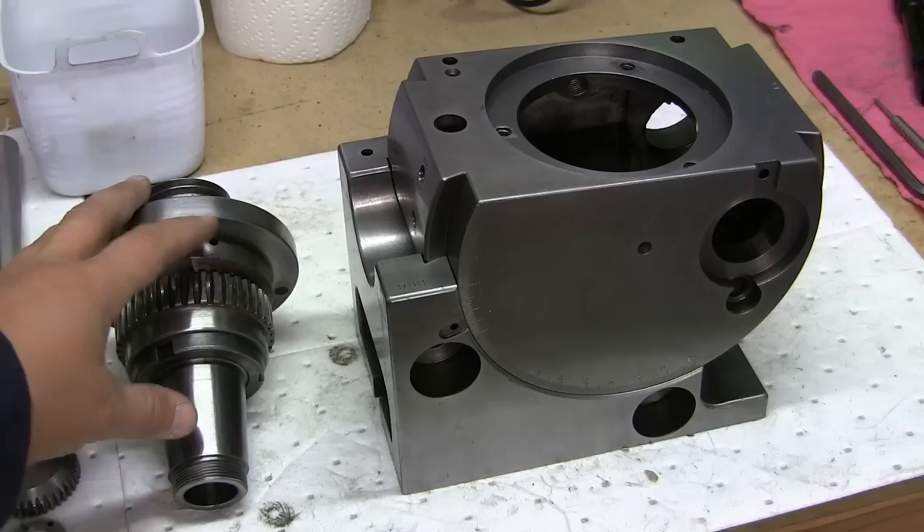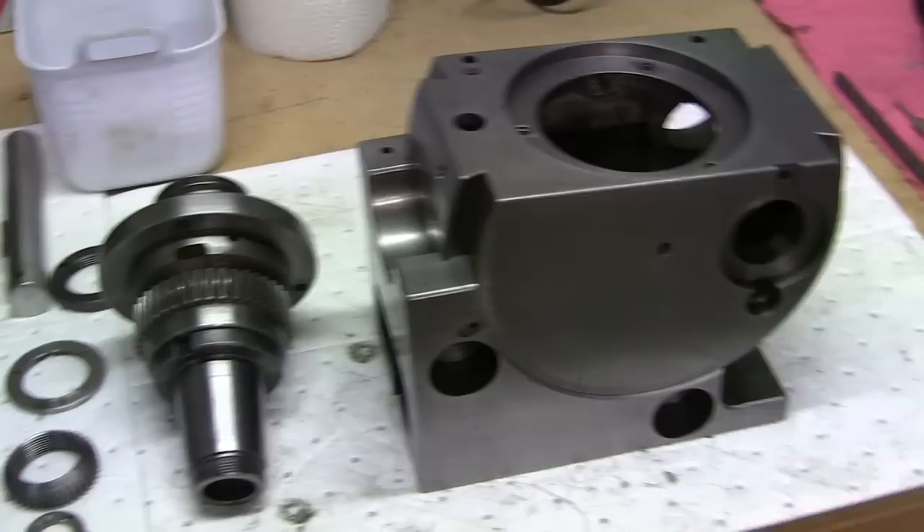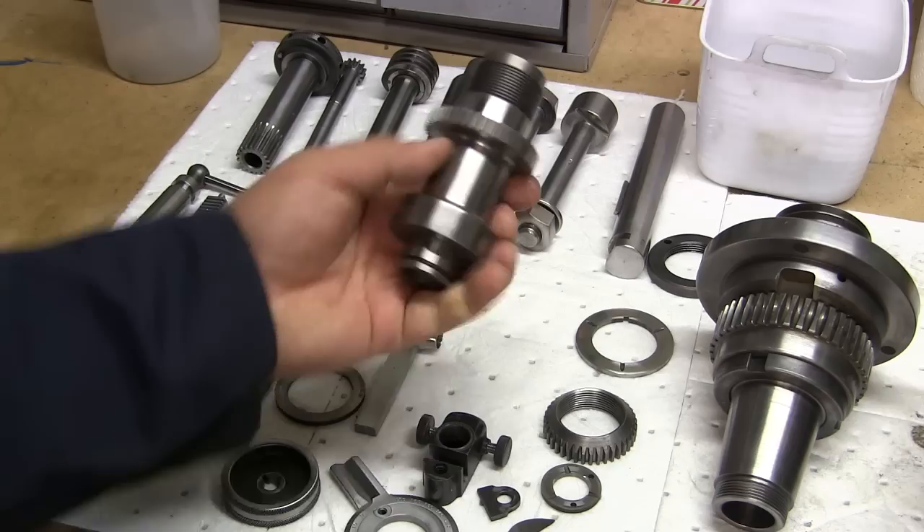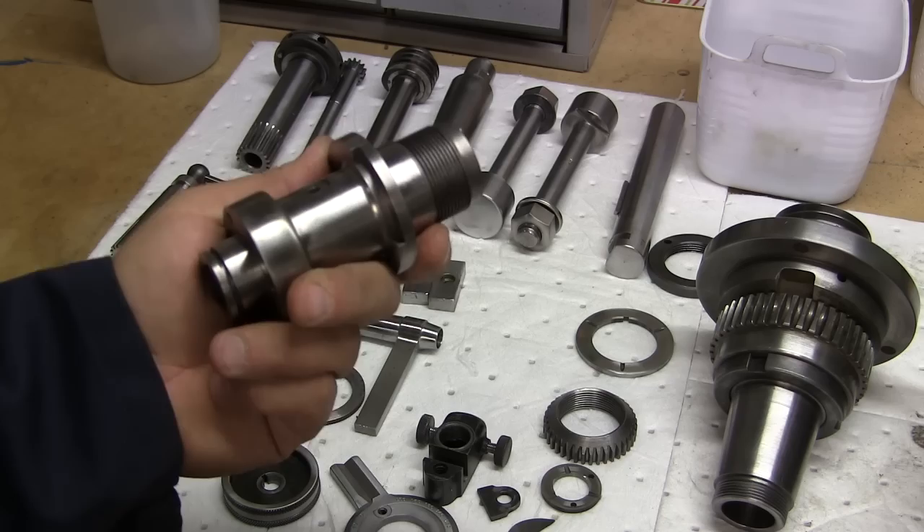What we have here is the castings — the two major castings. We've got the spindle, and over here I've got all the parts laid out, spaced out nice so I can see them, and we can begin putting it all back together again. The first thing we're going to do is put this piece on — this is the handle, where the handle attaches and some gears and whatnot. This was the last piece I took off, so I'm going to go in reverse order and put it all back together.